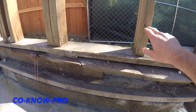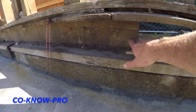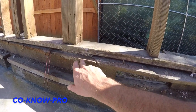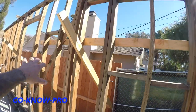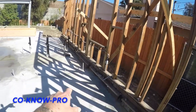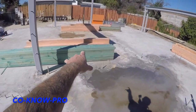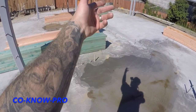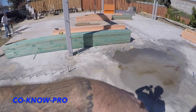We'll throw in a new bottom plate that'll drop down on top of this — might have to put a three-quarter inch rip of plywood in there, we'll see. This is going to take some love. We've got to dial that wall in, but we're ready to start framing. We have all our three-inch pressure treated, and the reason we have to have three-inch pressure treated is because this is not only a two-story — we have level five and level six shear walls.